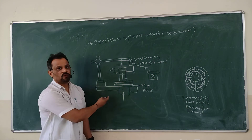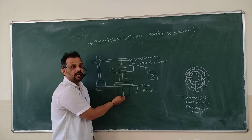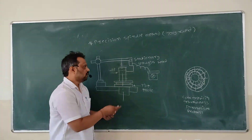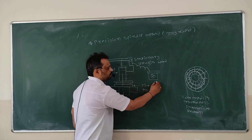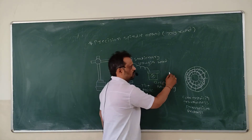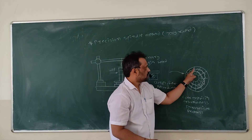Now working of the tilting of this machine — this is your workpiece which is mounted on your tilting table. Below this tilting table there is a motor which rotates your job, and you have to place your pointer against your rotating job. When this tilting table rotates your workpiece, this pointer will receive micron signals and give it to your amplifier and recording device, which gives you output like this in a polar graph.